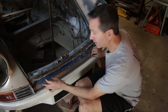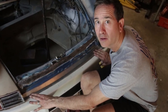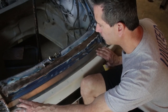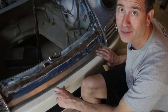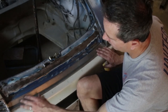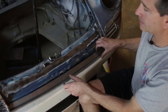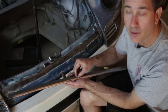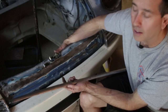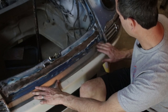This piece is now formed and you can get an idea of how it fits on. It really closes out this empty space and it's definitely going to provide some support to this fiberglass bumper, which is not super strong — it's very lightweight. But I really like having something solid to attach it to. I haven't made the tabs on the back side yet. I'm probably going to weld some tabs on the back so I can put nuts on and then drill holes and screw it in permanently.